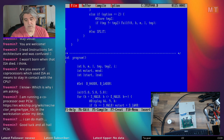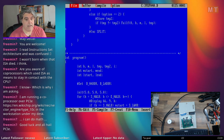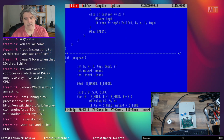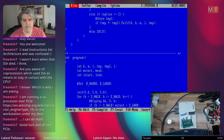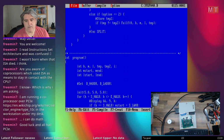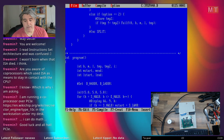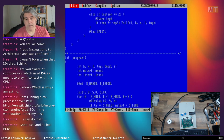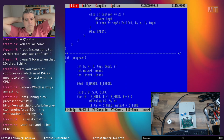So controlling those chips is child's play. That's well documented. The data sheets for all those chips are available, and you can communicate with those easily. It's a question of how the chips then interface with everything else in the SuperPro programmer for generating all the right voltages and logic levels and reading in the data and all that sort of thing. It is a little more tricky, but not impossible to work out. So yeah, making my own software for it would be a possibility.